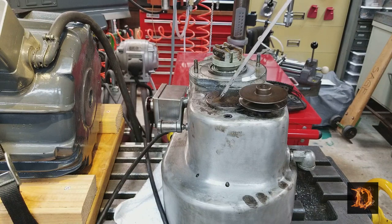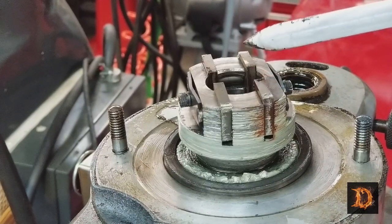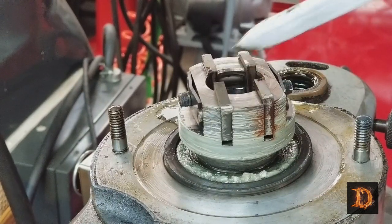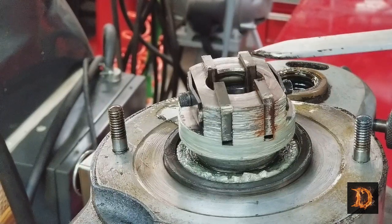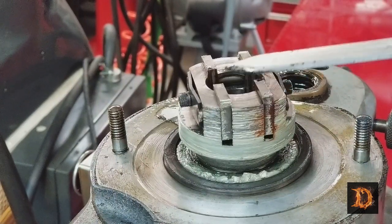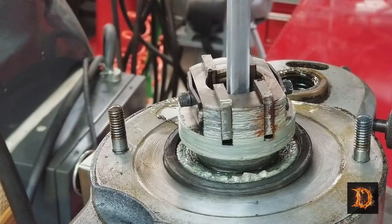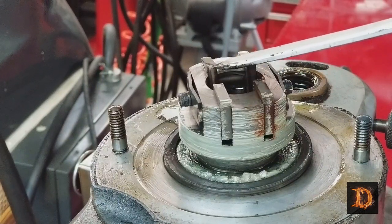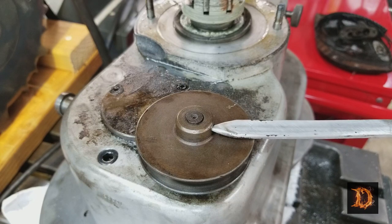There's a bearing cap here. I have to take this pulley off in order to get these three screws out. Tree had a great idea having rollers here that are adjusted by eccentric pins on the side, but over time the rollers would beat up the spindle, so there was an option later on to upgrade to these flat rollers, if you will, and these hardened flat pieces now align the spindle up and down. And any bumps that are on the spindle that were caused by the rollers, these flat pieces just roll over any of those bumps. So we got to get this pulley off, and there's a set screw here.